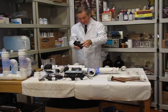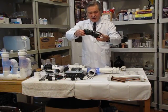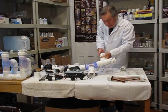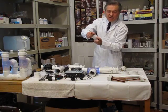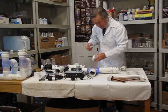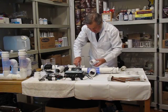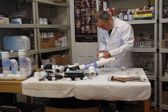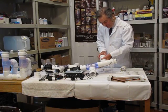This is one of these quick-connect connectors close up — you get a very positive disconnect and connect. When screwing in threaded fittings, it is far better to use Teflon cement rather than Teflon tape. Put this over all of the threaded surfaces on both sides, and that will give you a much more reliable, effective seal. This is also where leaks often occur, and the Teflon cement acts as a lubricant for a very clean threaded connection.